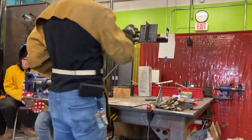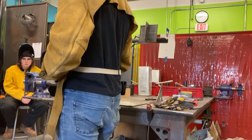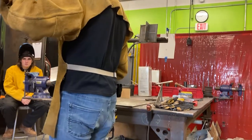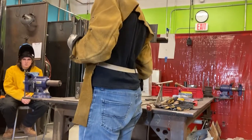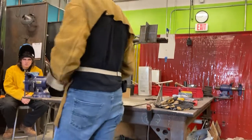You may notice that here, I've got lots of blocks in the last group of it. You may want to try clamping one on, because the heat is going to build up and it's going to be very difficult to deal with. Now, I'll show you strategies to deal with that. Something called backstitching. I'll show you that later on.